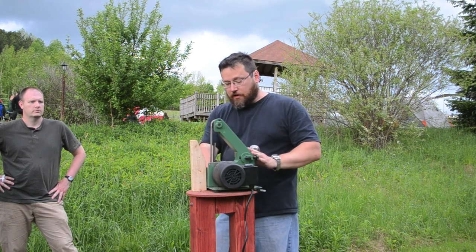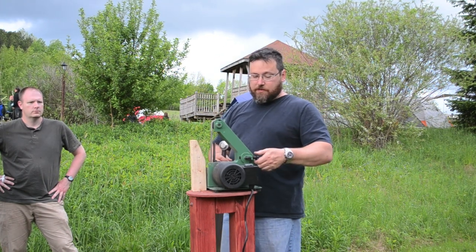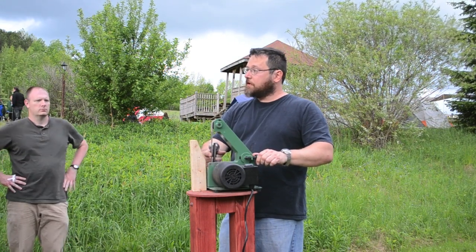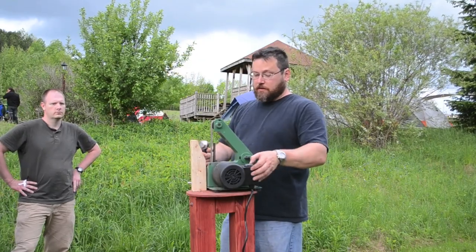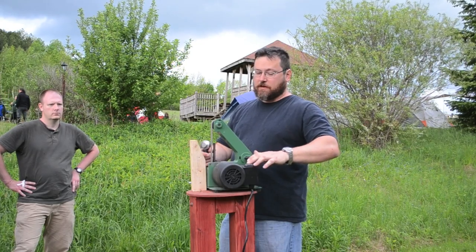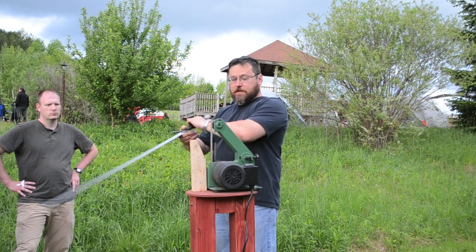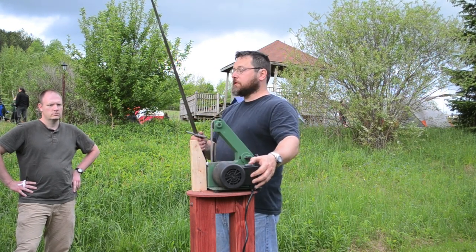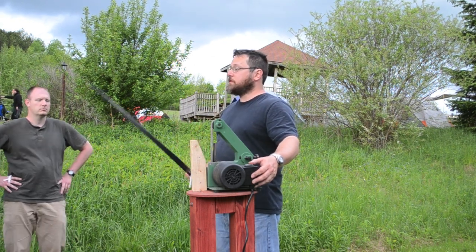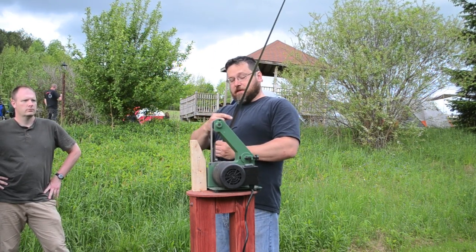One thing you have to check all the time is that the belt is tight, because if it's not, you'll ruin the finish on your sword. You're holding the blade with your hand and I usually sharpen to about here, because the ricasso area doesn't really cut. You lay the sword onto the block, and then using your body — not your hands — you move back and forth. When you move your hands the angle shifts, but when you move your body, the edge angle stays consistent. It's very rhythmic. You can listen to music while you're doing it.